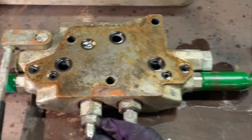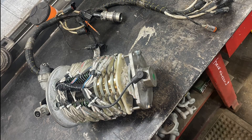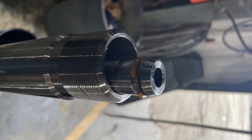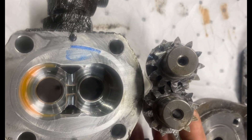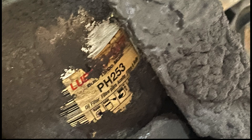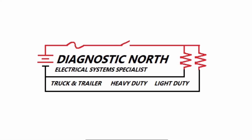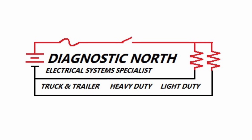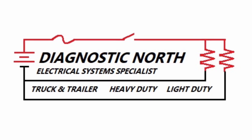My background allowed me to take on these kinds of jobs. Early on in my career I was a heavy duty tech before I got into truck engine diagnosing. As a heavy duty tech, you deal mainly in hydraulics — I've seen it all: cylinders explode, functions go limp, priority valves not prioritizing flow, load-sense systems not working correctly and stalling out an engine, high resistance return to tank due to incorrect viscosity hydraulic oil. Hydraulic systems are also extremely susceptible to dirt — when's the last time you changed your hydraulic filters?